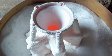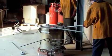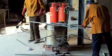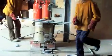We like to pour the molten bronze into a hot shell because it allows the bronze to go in without chilling too quickly and freezing. If it's a hot shell it doesn't freeze so quickly, and in this particular shell it's some cow's heads which have got horns and ears, and you want the bronze to sort of search out the detail of those sculptures.